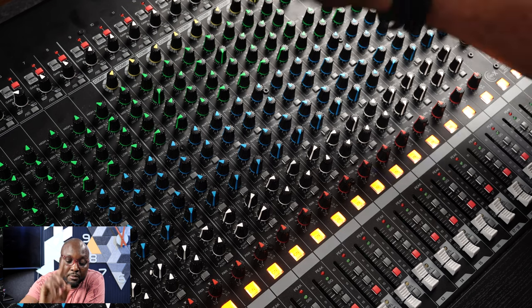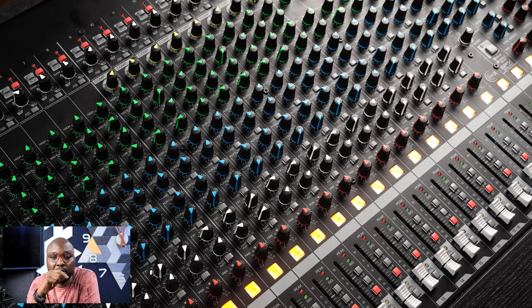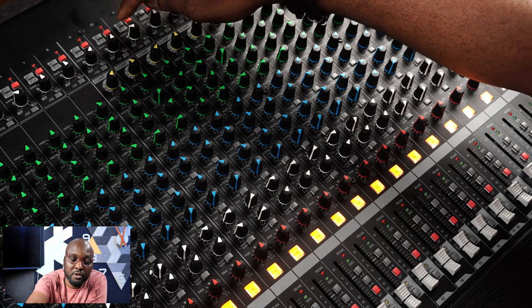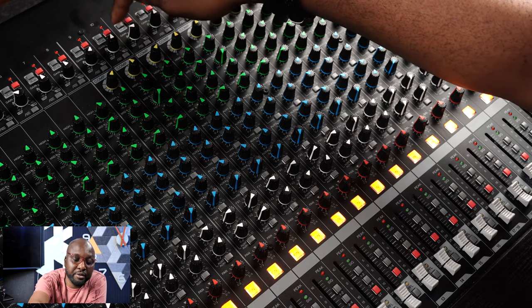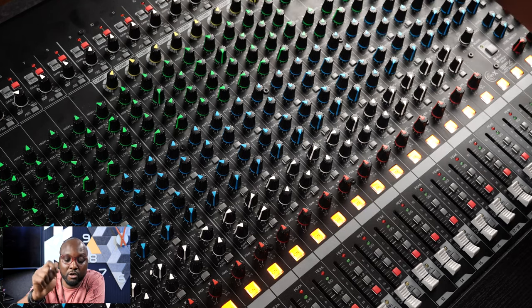And that's number one. Number two is that the first knob, which is this gray knob, if you are coming in from line level, okay? Line level may be too powerful for the mic level, which is going to be that the unity gain on this knob, you have to engage the 26 dB to cut down on the input source, okay? If you are coming from line level, the input may be too hot for a mic level. So you have to press the 26 dB to cut down on the gain of the microphone, all right? Or on the line level.